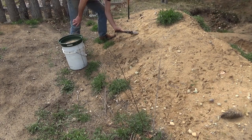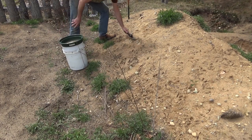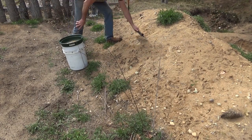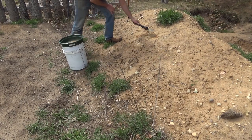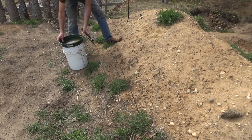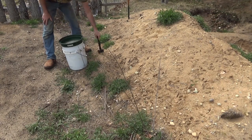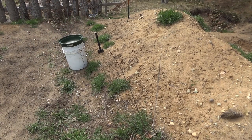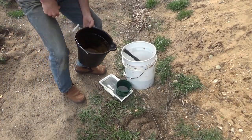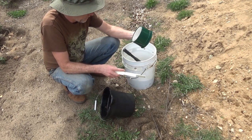Hopefully I can get enough to do a casting. Yeah, that's sifting out. I know I'm going to need some moisture, but I don't want it too wet. I'm going to proceed to classify this out and get about a third of a bucket of sand, then classify it again finer. I want really fine — probably 100 mesh — so I have some really good fine grain. The finer the sand, the better your mold is going to be and the better your end product.